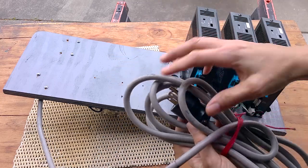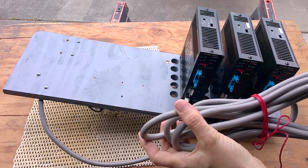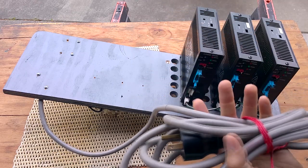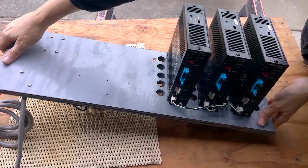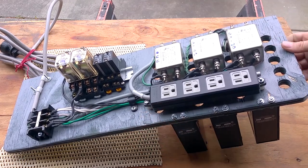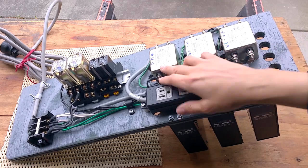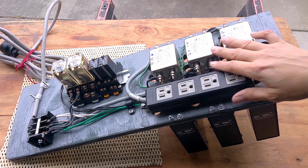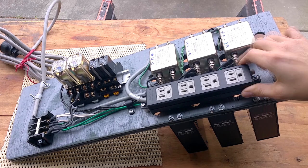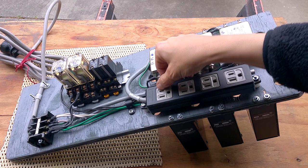I've got a big heavy-duty AC line cord here. This is used, but I chopped a few inches off each end to make sure the wear was gone. It seems appropriate for 15 or 20 amps. On this side I wanted a few different circuits: one for accessories with an AC outlet strip, another for the stepper motors, and a third for the spindle motor. I found this little industrial outlet, but oddly it was wired wrong.